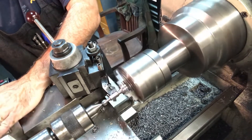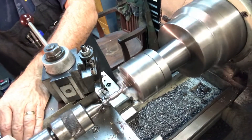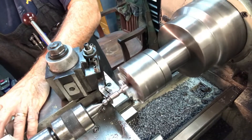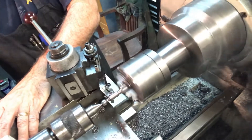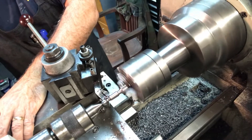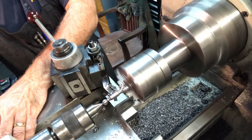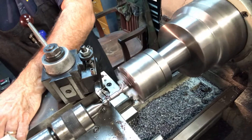I really do like this little diamond tool holder. You could use any kind of cutter, obviously, but a diamond tool holder is really neat because it uses that quarter-inch piece of high-speed steel. You can touch it up with an actual diamond stick or an Arkansas stone in between uses. You get a lot of uses out of one sharpening, and if it gets really dull you can put it on the little grinding attachment, touch it up against your bench grinder, and you're good to go for a long time.